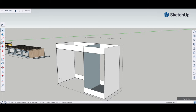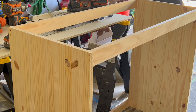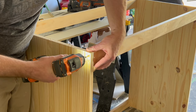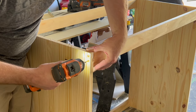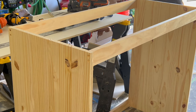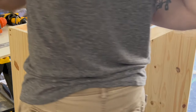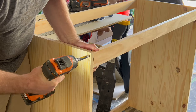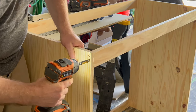It's not going to be exactly what the original design was. It's going to be something a little bit more akin to this where we basically got three upright boards along with a front, a back, and a base board. Now both the ends and the vertical divider are made out of one inch plywood — hobby plywood from Lowe's. It's pretty light, and the reason I went to one inch rather than half inch is just to have some bite on it when I get the screws.